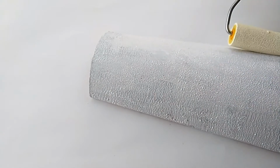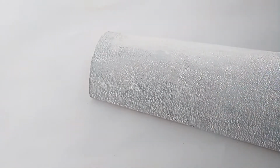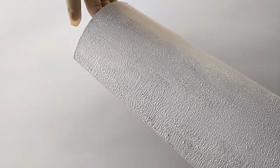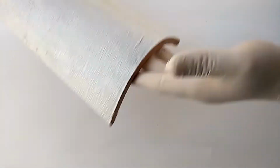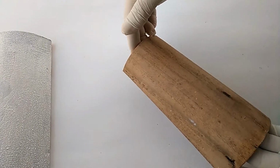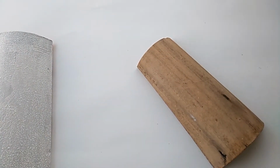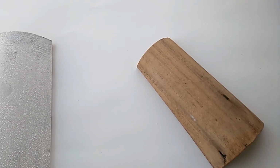This application that you are seeing, what we call priming, is applied in the same way when it comes to other supports, such as a sheet metal roof, cement terrace or tiling. And the same procedure if we apply it on walls. When it is a large installation, you have to use large rollers, brushes and extensions that facilitate the application. If we have a special machine to apply it by spray gun, it is also always a good option.